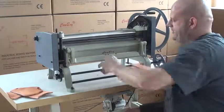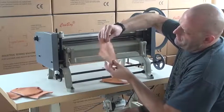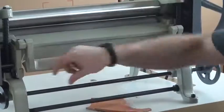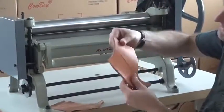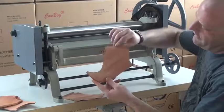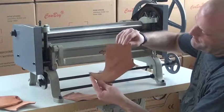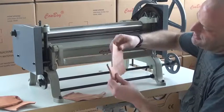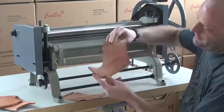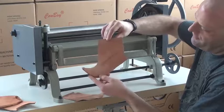You can see I had it set to split off a very thin sliver of leather, and you can see how nice and even that split is throughout the piece. It is in fact a very thin piece of leather that we split off the bottom side. This was approximately 14 to 15 ounce leather that we put through the machine. You can also see on the back side where we performed the split — the split is very even. You can actually see a sheen on the back side of the leather indicating that this blade is razor sharp. We actually take the time to hand sharpen and hollow grind and polish each one of the blades on these machines, and as you can see the proof is in the pudding — this is a very solid and very nice, even split throughout.